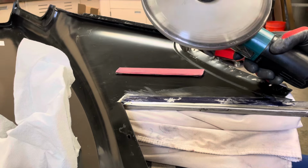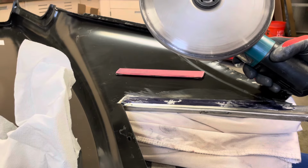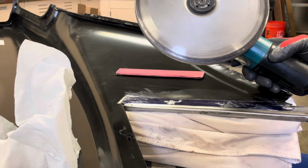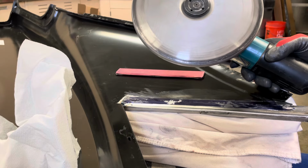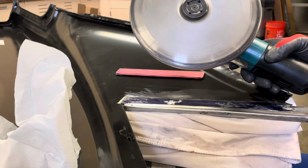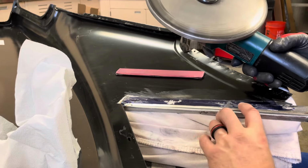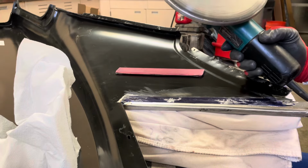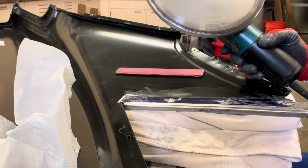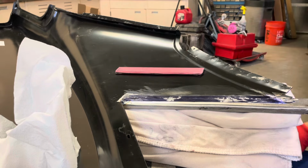And so you see where I've got into my paint over here, but that'll clean off, no big deal. But yeah, you're supposed to have a nut that actually recesses down in there, which I don't have. I'm going to have to figure that out. Because you want to be able to just glide this thing across the panel, just touching the top, just touching these high spots. So when this is down, in theory, it should be only touching those high spots, which heats that up, and then you quench it and it brings it back down. So that's the thought behind this. I think I'm right, I don't know. Who knows? I'm sure somebody out there can tell me I'm wrong.